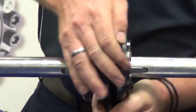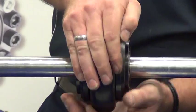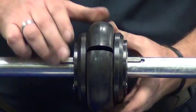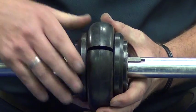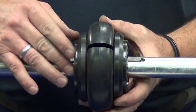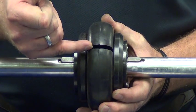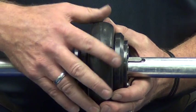This may need the assistance of a bit of a helping hand. Once we've got the tyre in there and we feel that it's seated nicely within the hubs, we then proceed to tighten the internal clamping ring bolts on either side of the coupling, ensuring that there is a specified gap between the two coupling element ends. In this particular case, that needs to be set at two millimeters.